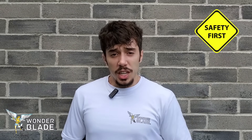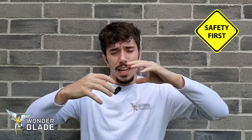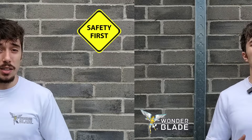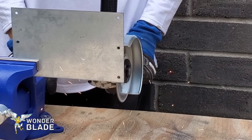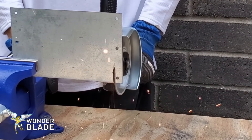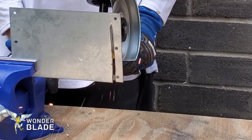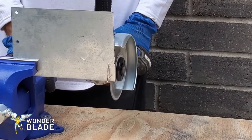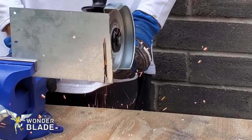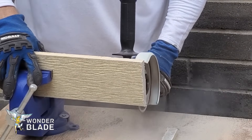Always make sure to wear safety glasses, gloves, and also long sleeves and pants when using an angle grinder so that debris doesn't shoot into your body. If you're cutting a metal plate, a reciprocating saw is going to make it wobbly, posing a safety hazard and resulting in a non-straight cut — again, this is where an angle grinder comes in handy. With this tough grit diamond blade, it can also cut through fiber cement, trim, siding, and even wood, and in our past video we've shown it cut tile as well.